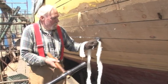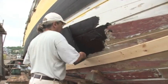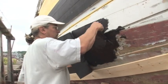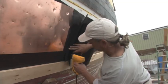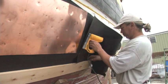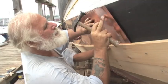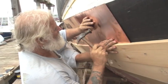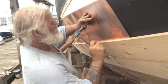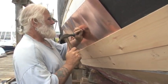In our previous episodes you saw us putting on the caulking. And so now what John has done, he's put tar on the side of the vessel over the caulk seams. And on top of that goes a layer of felt — it's just plain 30-pound roofer's felt. And then over that will be the copper; we'll nail the copper on over that. And this will form a barrier against worms that is absolutely 100% effective, and should be good for probably up to 20 years.